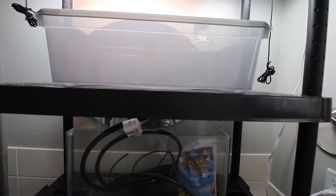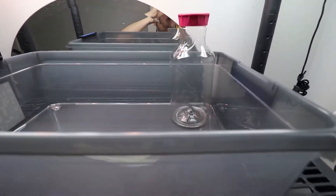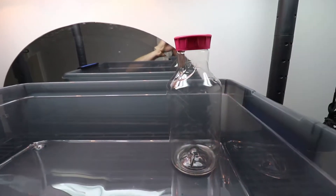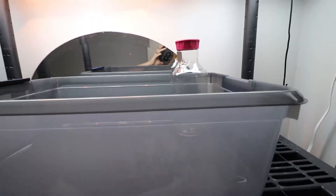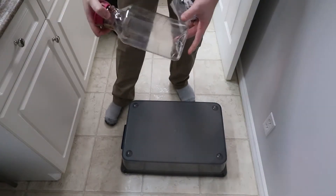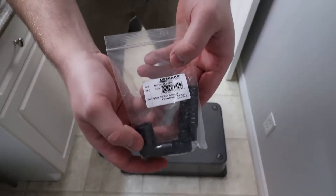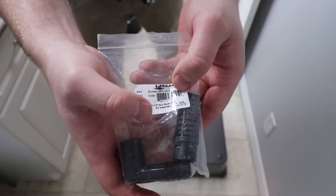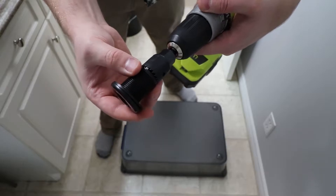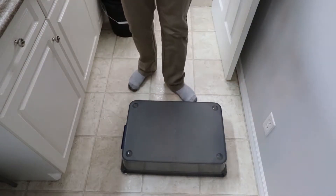Before I make my cut, I'm just mocking everything out here. I have a simple plastic stand — the aquarium's going to go underneath, grow bed on top, and I want the down pipe for the return just in the back corner. This container keeps the media from getting back into the return pipe. I'll mark that and then cut. For what hole size we're using — it says on the bag for this size of bulkhead we're going to use a one and one-eighth inch hole. If it doesn't tell you, just match up roughly the same size — it needs to be underneath the gasket area.